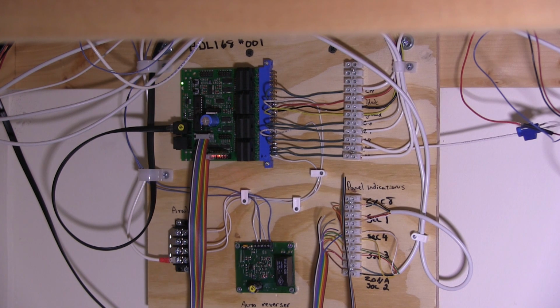And then I went back in my directions and I saw where it actually says right in the directions, only the M pin. So I had to come in and cut the pin, and then powered it back up and everything worked. So just remember that if you're going to use this card and you're setting it up, your ground wire only goes to the lettered pin, not the numbered pin.